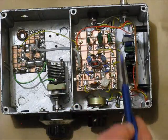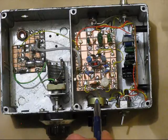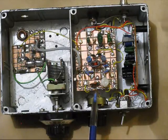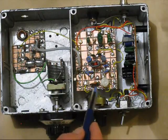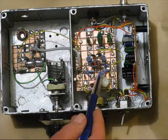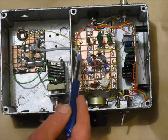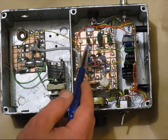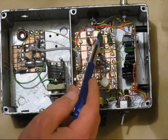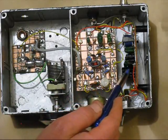The incoming signal comes from the antenna socket, via an RF gain control — which also acts as the volume control, so you don't need two of them in a simple receiver — and then into an RF preamp. From the output of the RF preamp, the signal goes into an RF phase shift network, just a capacitor and a trimmer resistor. That splits the signal into two and feeds it into the diode balance mixer. Mixing it with the local oscillator signal from the VFO, the now-audio signal goes to an audio phase shift network comprising a few capacitors and resistors.